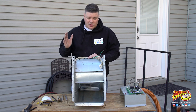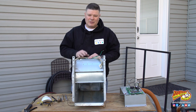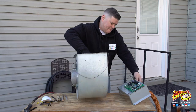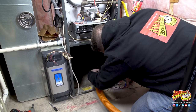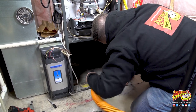The last thing we have to do is put everything back in, and hopefully the notes we took to hook everything back up work and the furnace comes back on. While you have the blower assembly out, go ahead and use your vacuum to vacuum out the inside of that furnace cavity as well. The more dirt you can get out of the system, the better.